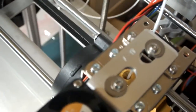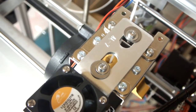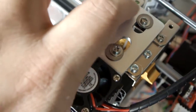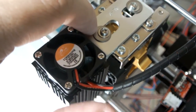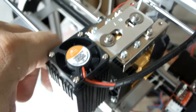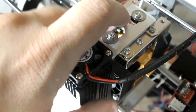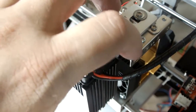I've got a three-hole piece coming across here and another one coming across there. I drilled two to three millimeters through that and then screwed in this aluminum — that's actually a three millimeter washer and a four or five millimeter washer — just to attach it. I'm going to unscrew this; it's just connected underneath with one three millimeter nut. Both of these will just take the whole laser assembly off.